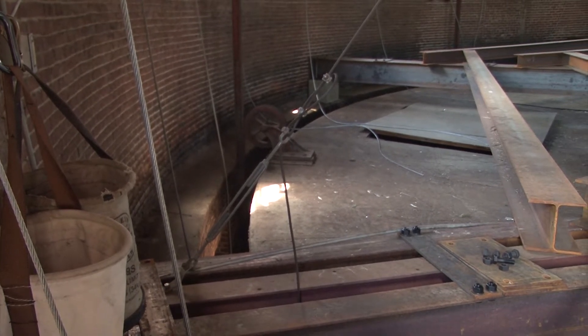We're building a structural steel grillage over the holder, on which we're going to build shoring frames that are going to come up. What we're going to do is pick up the roof — we're not really going to lift it right now, we're going to hold it in place. The shoring frames are essentially scaffolding, but more heavy-duty style than typical pipe staging. Those shoring frames will go all the way up to the roof to support the framing and the slate roofing on top of the framing.